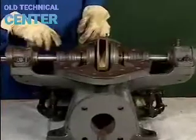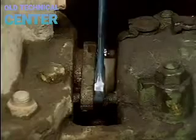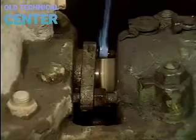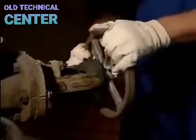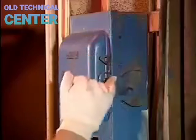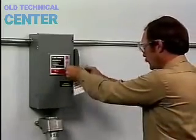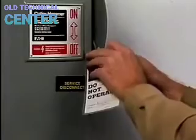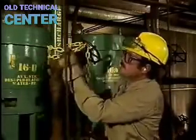When troubleshooting requires examining internal parts, the pump must be shut down and prepared for disassembly. Unless a problem can be solved by adjusting external parts such as the gland follower or casing bolts, or by addressing the system the pump is part of, you'll need to open the pump. Always follow your plant's lockout-tagout procedures to ensure the pump cannot be accidentally turned on while you're working on it. If unsure about lockout-tagout requirements, check with your supervisor.